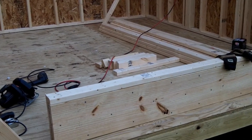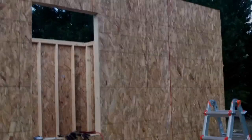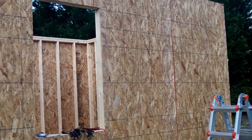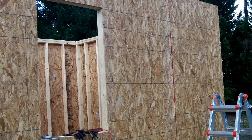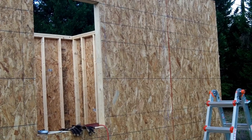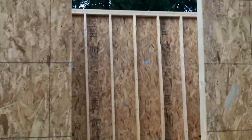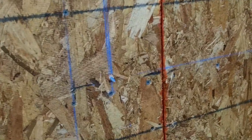That's what I've got right now. I'm going to call it a night and then tomorrow I'll try to put that wall together. One thing I wanted to mention about the windows: I put plywood over those, and I saw online an easy way to cut them out. I'll show you over here — I already cut this one out. On the inside corners of the windows, I drilled screws through and left just enough sticking out to run a chalk line to all four corners.